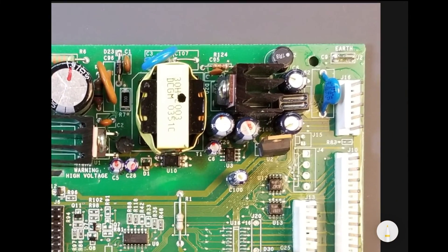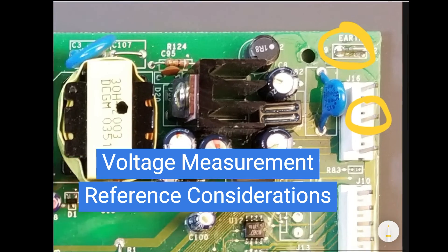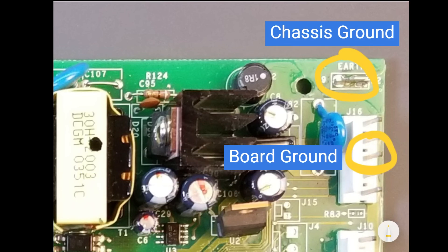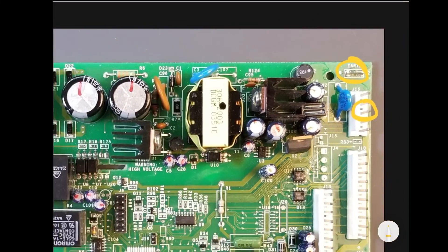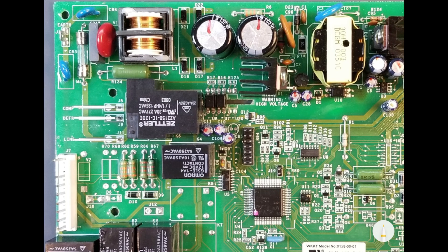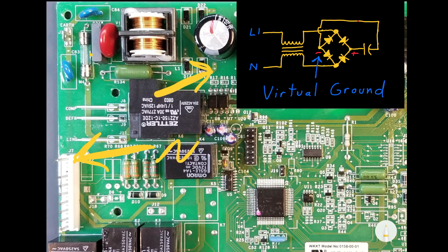It is important to note that in this model, the DC or low voltage ground is not connected to the chassis or earth ground. So when troubleshooting or measuring voltages on the low voltage side, you would use board ground rather than chassis ground. Not all boards are floating like this — some power supply grounds are bonded to the chassis. However, in these cases, any current flowing out of the DC supply will only flow through the chassis in an attempt to return to its source, which is the low voltage power supply. Also note that when measuring voltages on the primary side of the power supply, you will reference neutral — until the voltage is rectified. Once rectified, a virtual ground is created by the bridge rectifier, and that virtual ground would be the basis for DC voltage measurements on the primary side.